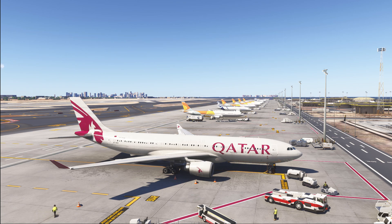Therefore, most operators have the 233-ton maximum takeoff weight A330-300, where an installation of the center tank simply doesn't make sense, since the maximum quantity of fuel will usually not be reached if you've got a decent amount of payload on board and have already reached the maximum takeoff weight.